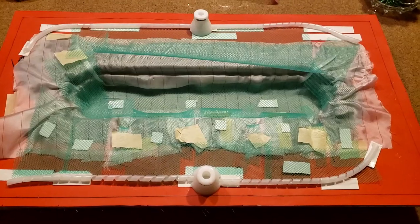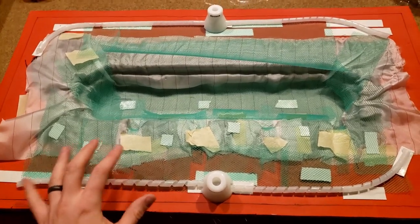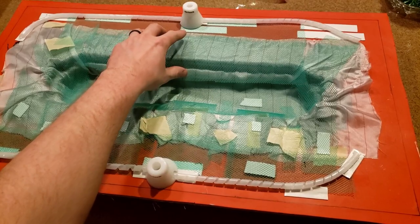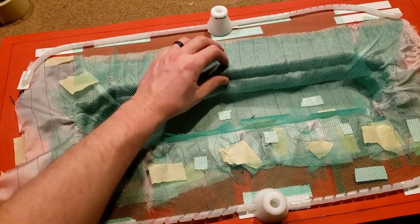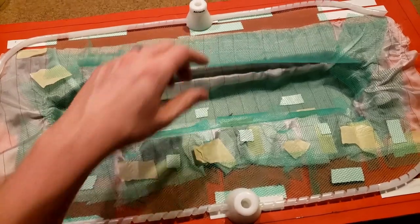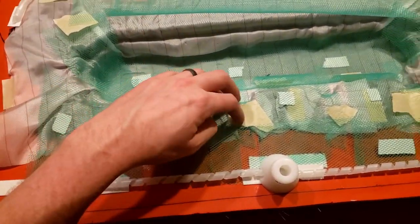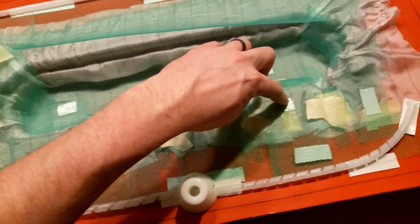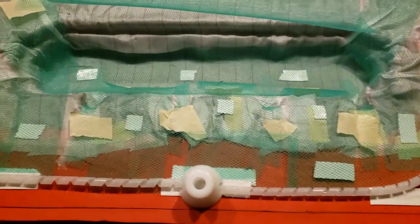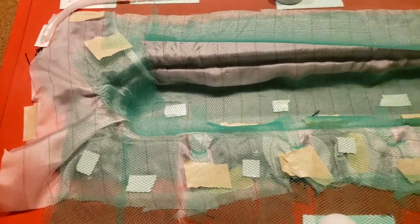it turns out. Okay, so we took this inside and I reworked it a little bit from last night when I filmed it. What I did before was I taped both ends of this, and that might cause an issue where it bridges because it could pull tight, pull the slack out and go tight in the middle. So what I did is I instead broke the pieces up into small sections of mesh and then only affix them at one point. That way there's no chance that anything could get tension in it and it shouldn't cause any bridging issues. So right now everything's done.